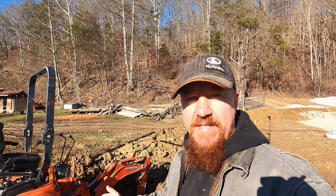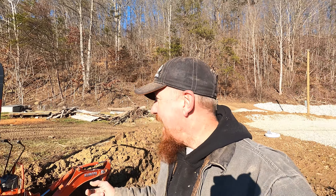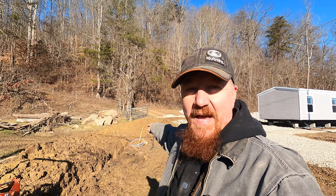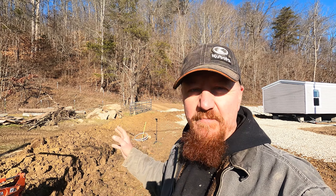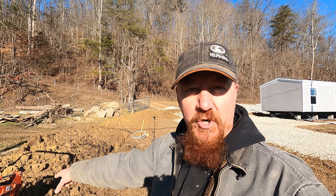What we've got to learn how to do is move the backhoe along the area where you're digging your ditch without having to get off. I dug a hundred feet last night, all the way around this corner right up here, without ever getting off the tractor — except to move cameras. I did all of my maneuvering sitting in that seat facing backwards, using the backhoe boom and dipper. We're going to show you how to do that.